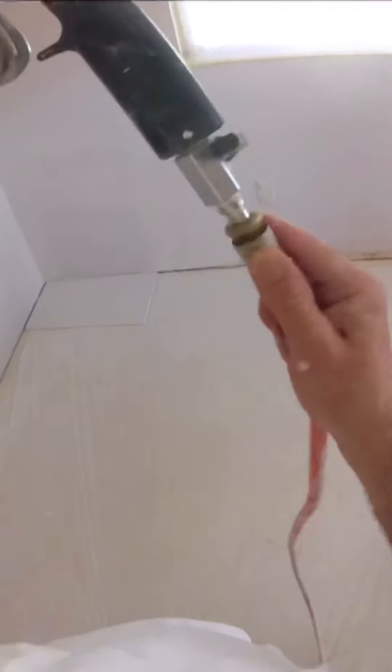Had to fill up a little more orange peel mix — put the pressure all the way up on high. Keep that hopper moving in a circular motion. You want to get total coverage with this orange peel texture, get it real good in the corner, and then blend it out into the existing — I call it feathering.